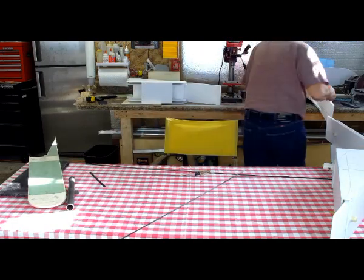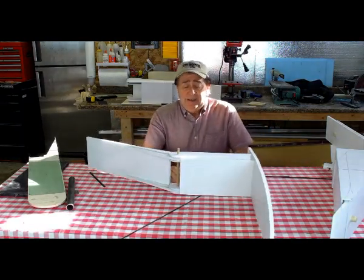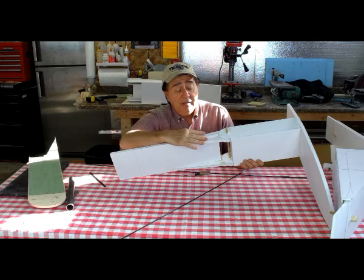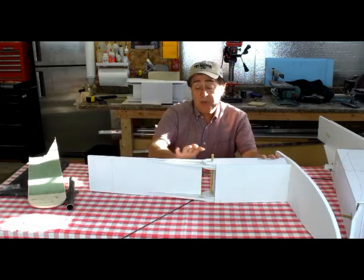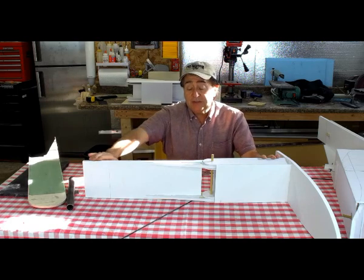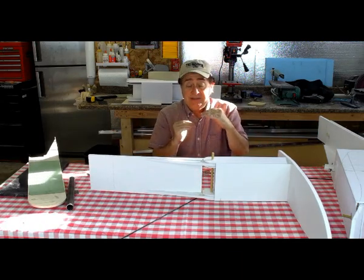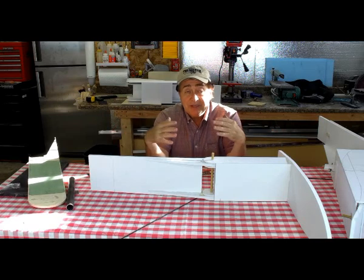Here is what I hope and believe is the final design. I've narrowed this up to three inches, and I changed the fitting from being offset off the back side of the shear web to straddling the shear web — you can see the shear web sticks up above it. That allows me to make the two fittings parallel to each other, which makes wing assembly easy on the alignment and makes it much easier to deal with the slope in the shear web. The shallow slope becomes problematic when you want this fitting parallel to the bottom fitting — there are small yet critical angles for field assembly; the parts have to be able to slide together without binding.